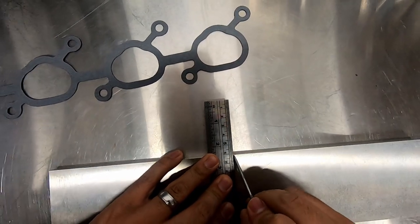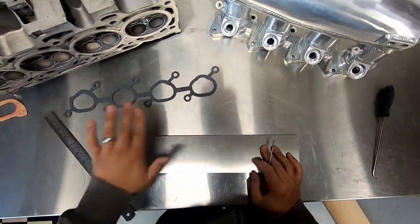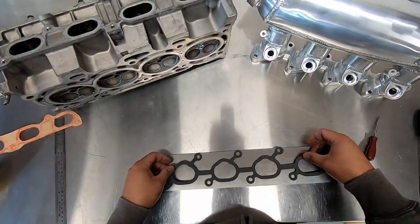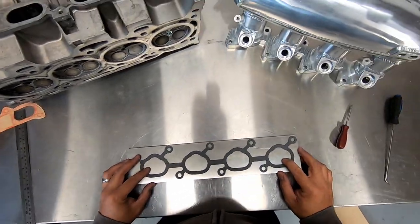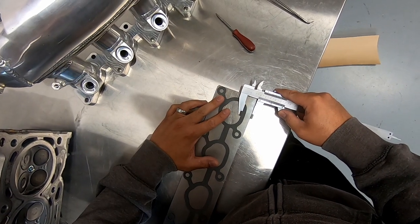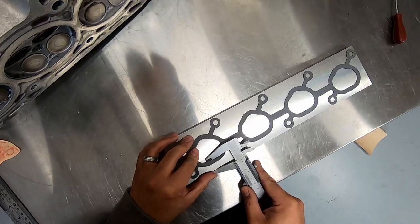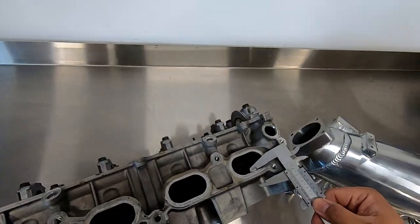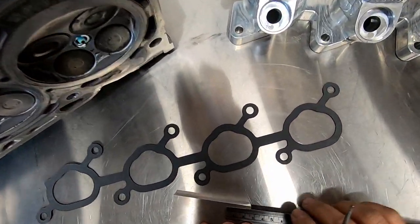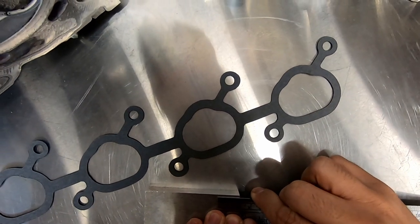As a flunked out engineer, I know whenever you're dimensioning anything, you need to find your datum point. This is the reference point that all measurements will be based off in a grid. To start, I'm measuring the straight bottom edge of the port to create a straight line on the plate. Then I can create the top line of the port on the plate, knowing that the port diameter is 31mm. I then use a center bolt hole on the cylinder head flange as my datum point, in which I can accurately measure out the port spacing and mounting holes for the plate.